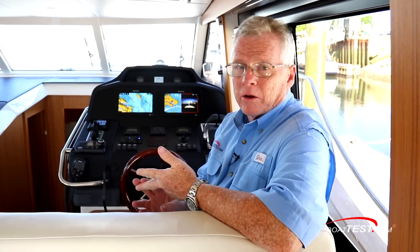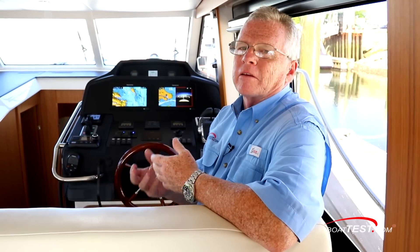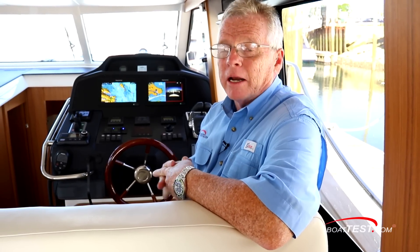Let's touch on the power aspect once more. We have the fuel burn for diesel engines and we know how much power we'll draw on the electric. We're going to be saving fuel, but it's not just about saving fuel — it's about convenience on multiple levels. Operating at idle speed: diesel engines do not want to be idling constantly; they need a load put on them. Anything other than that is kind of torturous to a diesel. That's the time to shut the diesel off, switch over to the electric, and maneuver around the mooring field, the marina, down the Intracoastal Waterway.